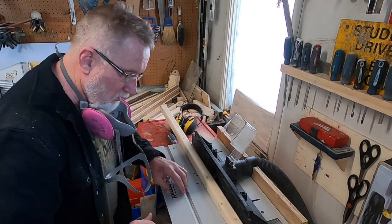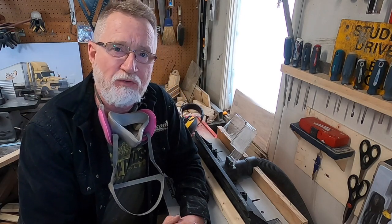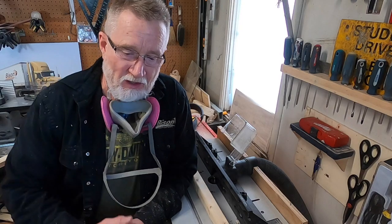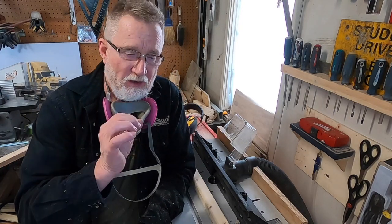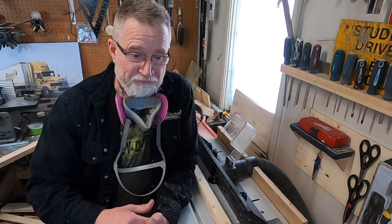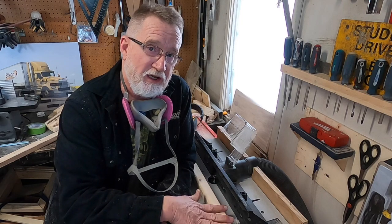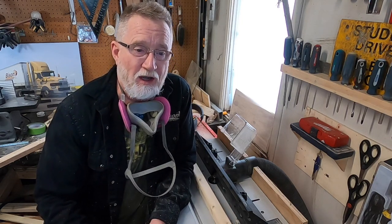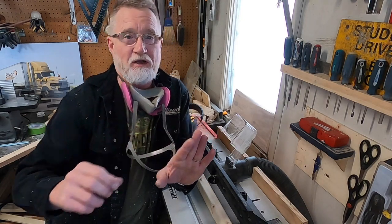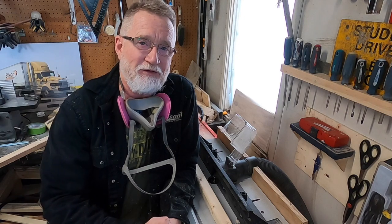So now we're going to set up the drill press. I'll set up my little jig, and then we'll start drilling the holes at the appropriate places. Just one point, I thought when I was doing all this routing, about how dangerous tools can actually be. Routers are very dangerous. The reason I bought this is I used to do everything on a 1/2 inch router, easing all this stuff. It's dangerous, it's very tippy, it's hard to stay attached to the piece of wood all the time, and my hand slipped into the router blade. Luckily I didn't lose the finger, but you can see that it's on an angle now. I'm going to show you a picture of what it looked like after they put stitches in it.